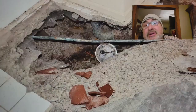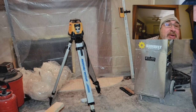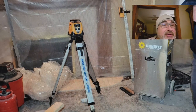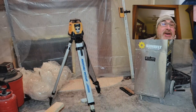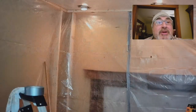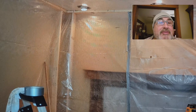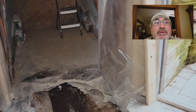I have other cases where we did tunnel underneath homes, but here it was easier just to dig it out. When you're doing this, a lot of times the people don't want to move, so you've got to move everything into certain rooms and put up your plastic. Then you have dust control — you've got to seal off the cold air returns. In this case, we're talking negative pressure because you're going to have humidity, so you have to run a dehumidifier. Otherwise you'll have condensation. This is probably a month-long job.